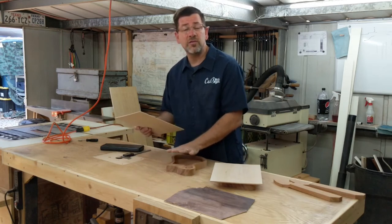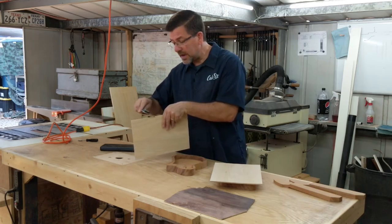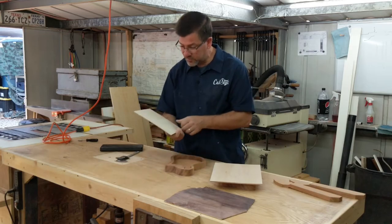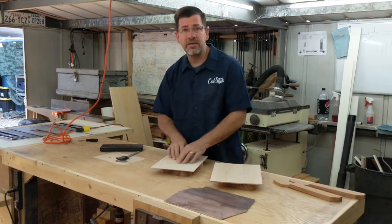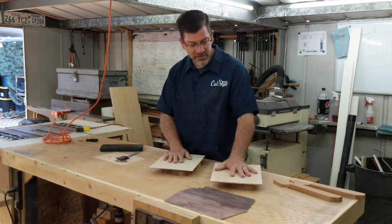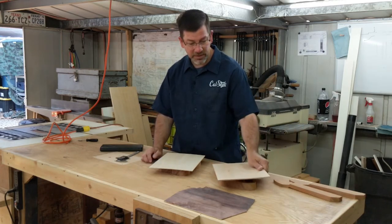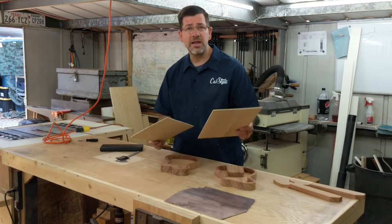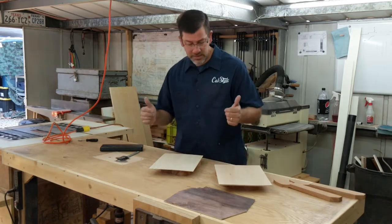However, on this other one that's using the transducer pickups, I need this top to resonate a little bit, and I went down to just a tad over 2.5 millimeters with the ash. So the ash is going on the sort of acoustic-ish electric, and the maple is going on the one that's getting the magnetic pickups. So I need to mark these out now and get them rough cut and start looking at the little F-hole cut that's going in the side, and just keep moving forward.